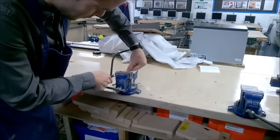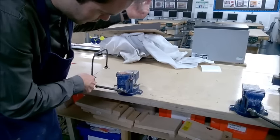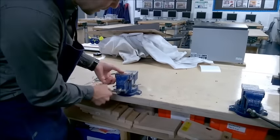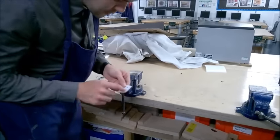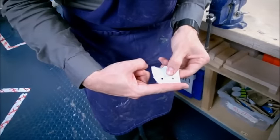I'm also not going to snap the work. When I get close to the edge I'll support the plastic to prevent it jumping up and away. Taking the piece out of the vice, you can see I've left about half a millimetre of space and I've got a fairly straight line.